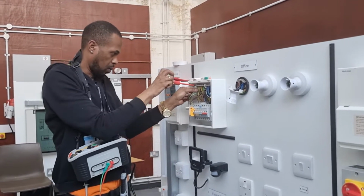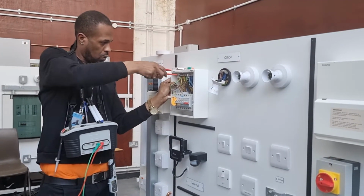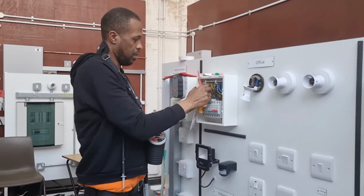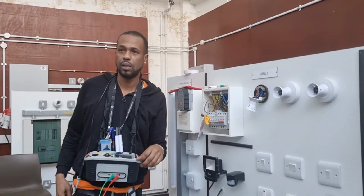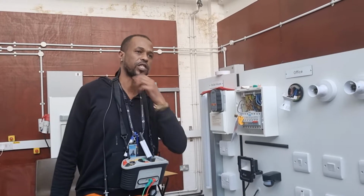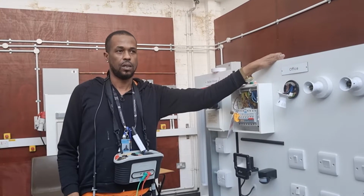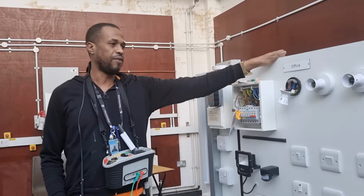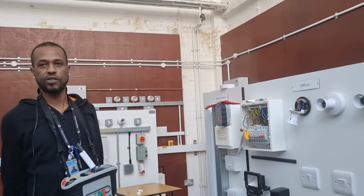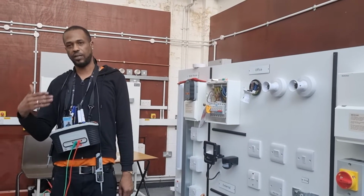You know the ZS, once you find it, is that the same one where, when you divide it by the voltage, you find the prospective fault current? Or is that something else? No, it's not. That's the formula for the PFC. Anyone remember that? What's the formula for the prospective fault current? Would that be volts over impedance? Yes, to get the prospective fault current.